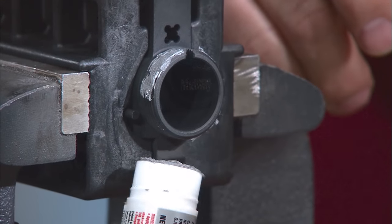To install the compensator all you need is a combo wrench and a vise. This is a standard A2 compensator. With the barrel in a vise, slip the crush washer over the muzzle and screw the compensator on by hand. Turn it to final position with the center cut straight up using a combo wrench. Now we're ready to combine the upper and lower receivers.